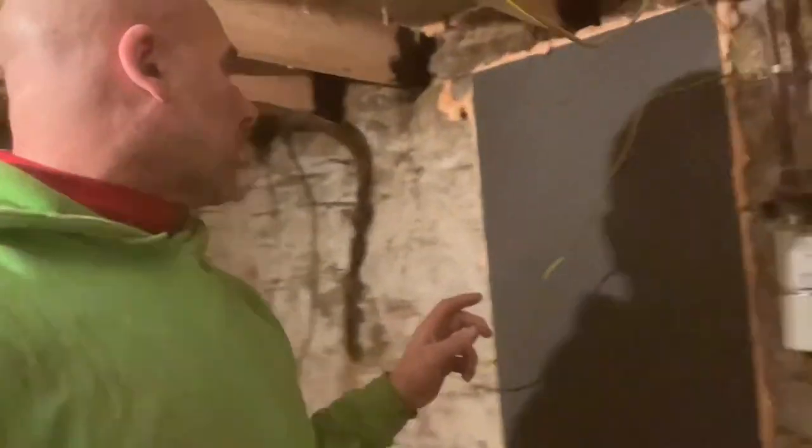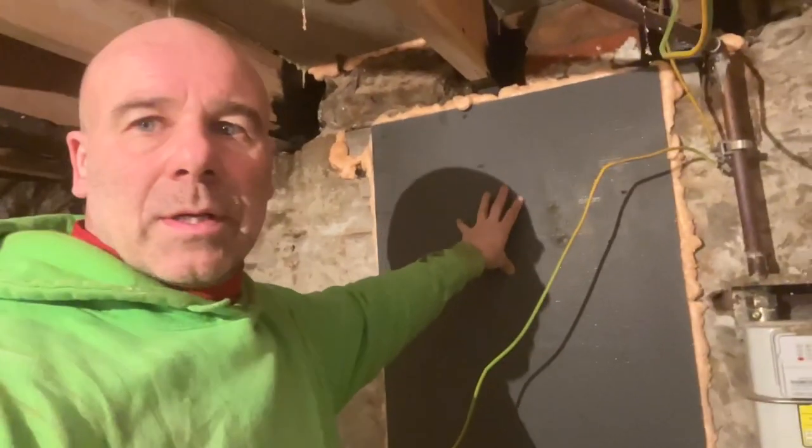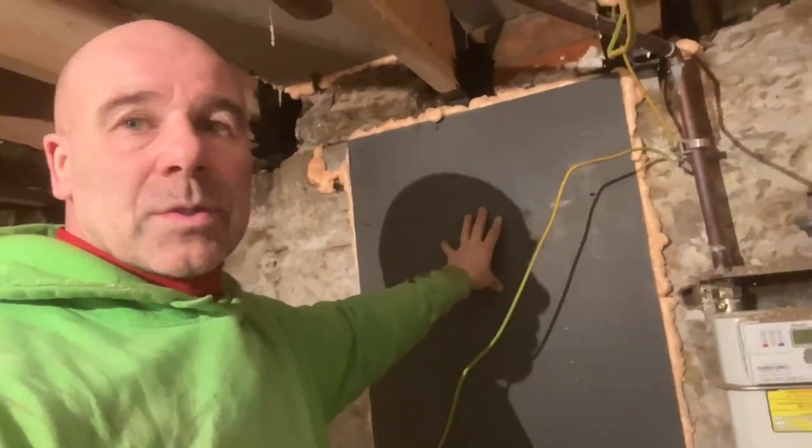Electrician's got to come towards end of week, and he'll mount a fan on here which is going to be a continuously running one. There's a cold place at the back that's venting air, just down at the bottom, so we didn't have to put one up front. But we've stuck a venting side here, so you've got plenty of airflow going into the cellar now.